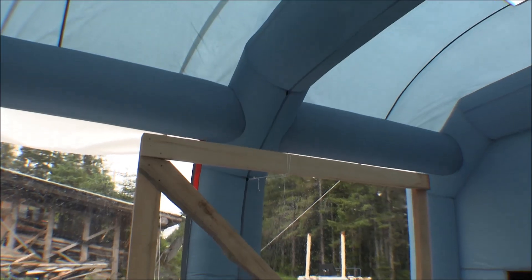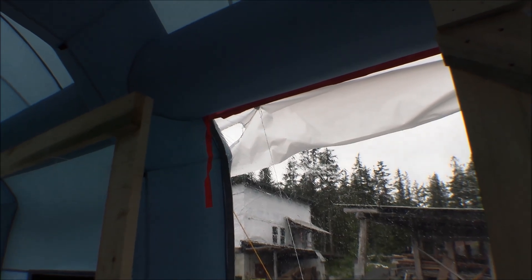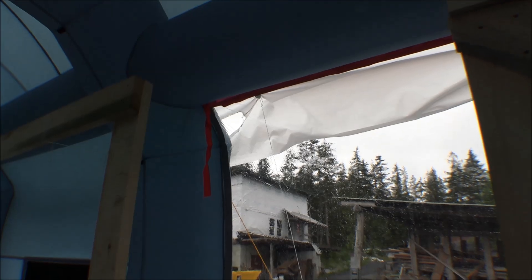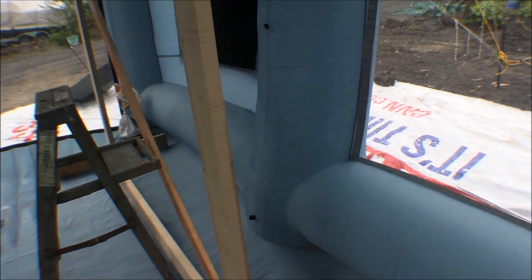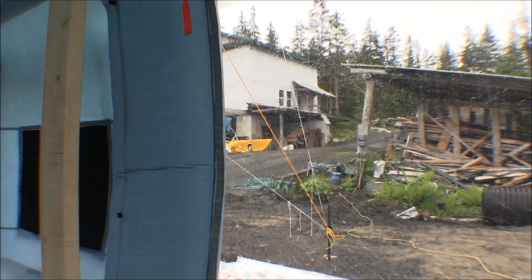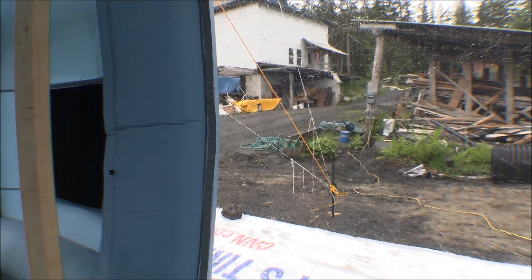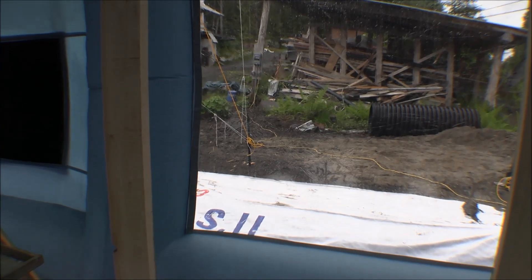So far I'm not getting anything coming from overhead — it's not raining from overhead, so that's good. I just made a little modification to my plastic on this one side. I had those tie-up balls — rubber balls pushed through the fat plastic with a string around them — coming down and attaching to the D-rings at the bottom of the columns. I just changed those and moved them out tight to my anchor stakes, so that'll pull the plastic edge out away from the building a little bit and hopefully more water will drip away from the building instead of coming right around it by capillary action.